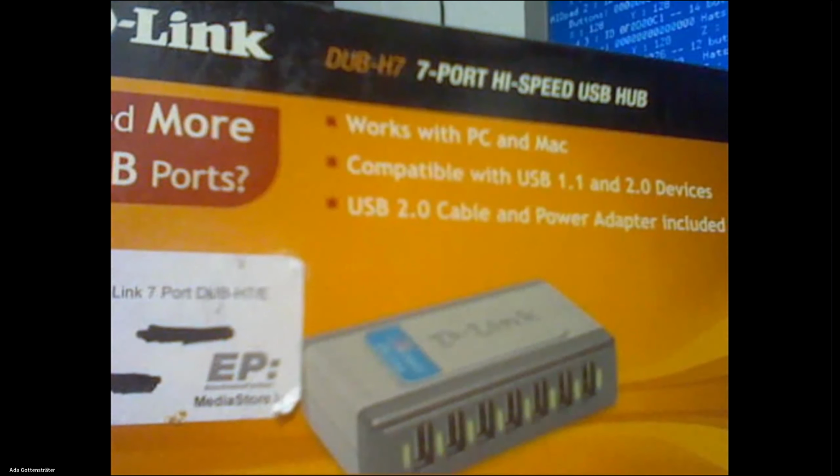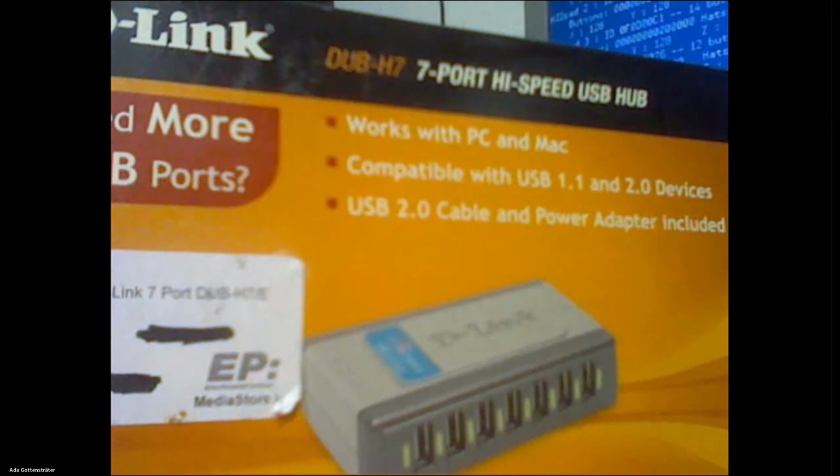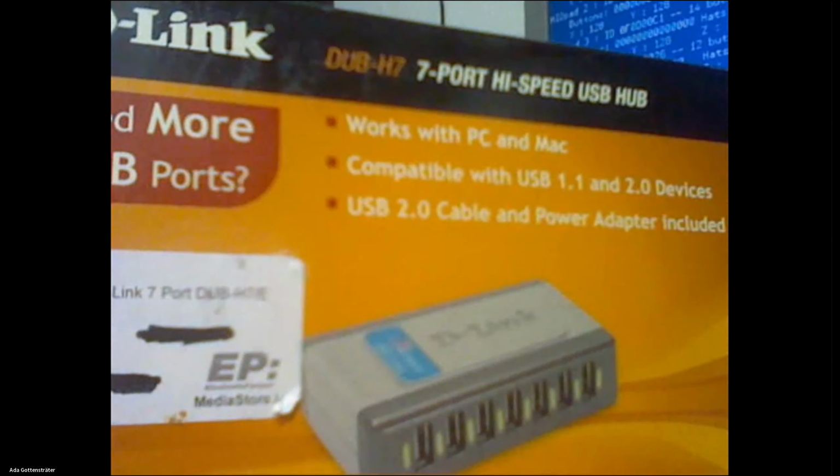It'd be interesting, but I'm actually more interested in mass storage on the device side, in terms of the P2 being a storage device to the PC. That'd be useful just for exposing the SD card so I can drag files onto it. You can technically transfer files over the serial link, but it's slow. Then you could have the P2 appear as a drive to any computer, right? So you could actually do some file transfer, and use it as actual data transfer. And the advantage here is, of course, that it can do 12 megabits in theory on the USB, and it can only do maybe 2 on the serial, and it's glitchy and just not good.